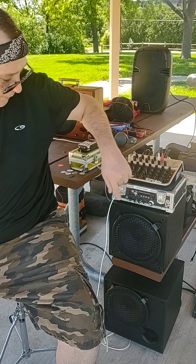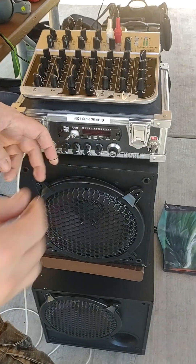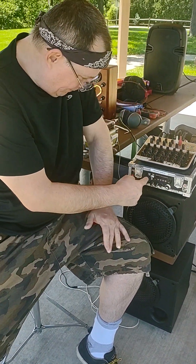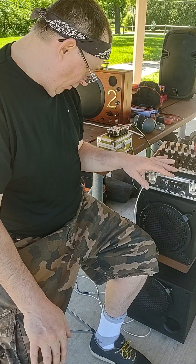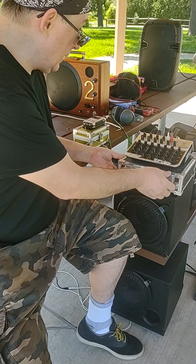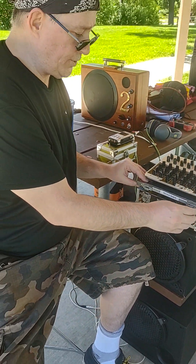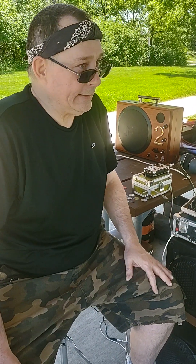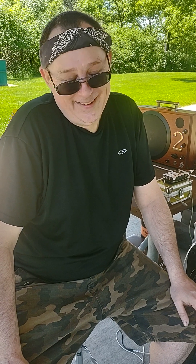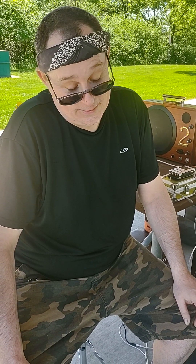This is our small rig. There's a foot switch that gives me play and pause. The backing tracks are on this memory card, and there's a backup TF card. This is a little MP3 player in the front. On this board they only give you op-amps on 4 of the channels, so I put a TL072 op-amp in here — but it turned out to be a counterfeit chip. Anytime you buy anything from eBay China and look at the chip, it'll have the part number on it, but trust me, that's not what it is. So I need to replace it.